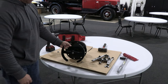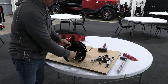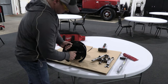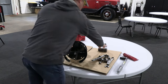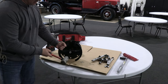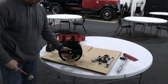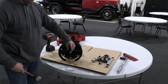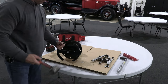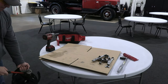Next step would be to remove the handle from the valve stem. In order to do that, the best way I've found is to start the nut back on here and get a hammer. To remove this, all you do is smack this. This has a high temp loctite on there — to put a puller on it you'd have to apply heat to break it loose. So the best thing to do is hammer, hold the valve out, and just smack it till the handle comes off.